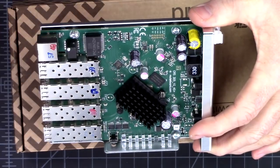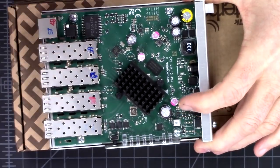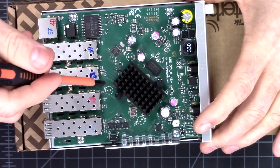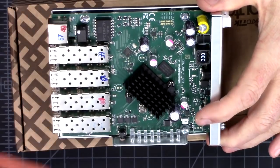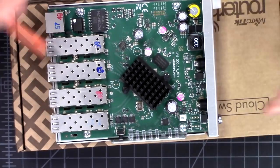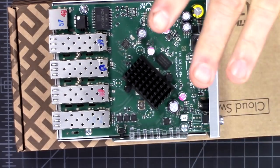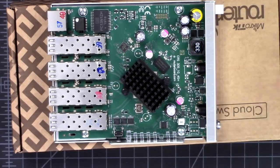One thing I'm going to say is this: these are your standard electrolytic capacitors — the less expensive kind. Provided this doesn't get too hot, the life of these can generally be pretty good, except when they get really hot they can dry out. So that is a design consideration — you don't want to put this in too hot of an environment. The switch itself does not run too hot, but if you were mounting this within a hot area, just think about that in terms of longevity.